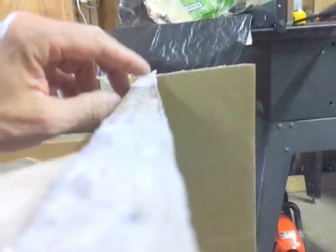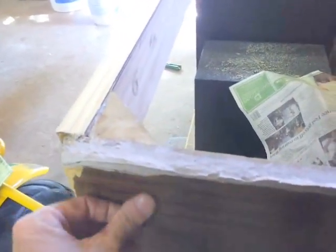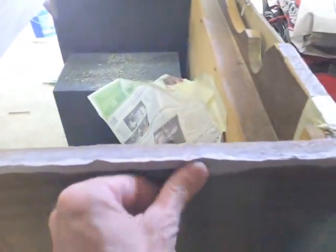I've taken the masking tape off, but if you look, you can see a little lip right here where the masking tape was. And that just keeps it from running over the edge. You can see it better here, but it gives you a little help in being able to backfill it, because this was pretty far down. Instead of going back and running thin coats and thin coats, trying to keep it from bleeding down along this edge, dripping, the masking tape kind of cleaned it up.